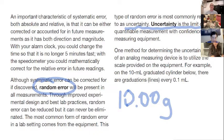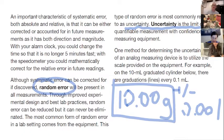We can actually calculate what our uncertainty is. If we want to measure 10.00 grams and our uncertainty is plus or minus 0.001 grams, we can be very certain we can measure that amount accurately. But if our uncertainty is plus or minus 0.1 grams, then there's really no way to measure 10.00 grams accurately — we would need to find another method.